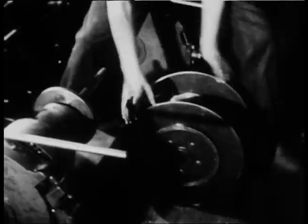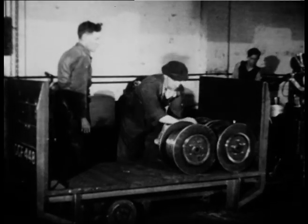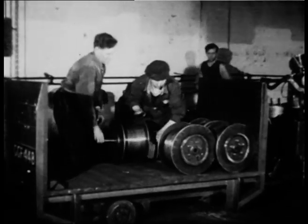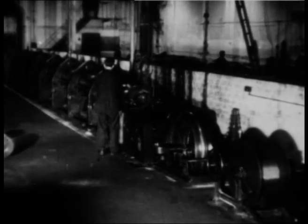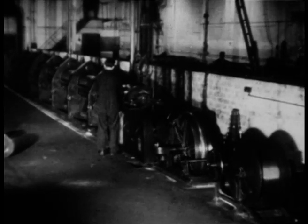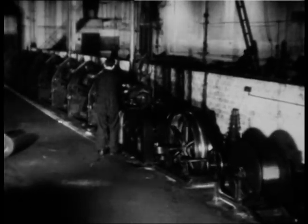As soon as the bobbin is evenly and completely wound, it goes on a truck to the stranding department, where a variety of machines perform the actual task of spinning the individual strands of the steel rope. Stranding machines are either of the snake type or the sun and planet. Here, for example, is a big snake machine loaded with 19 wires of three different gauges. A wire in the center covered by 9 small gauge wires, covered again by 9 of a larger gauge.